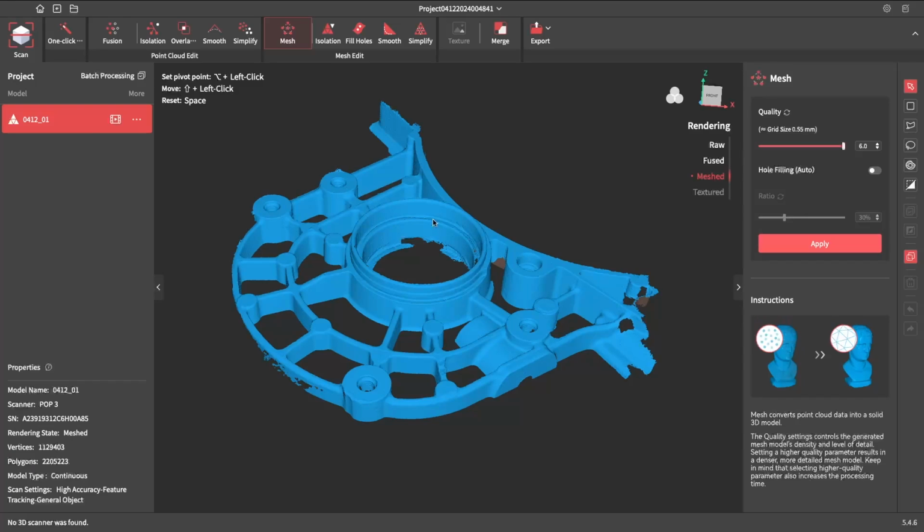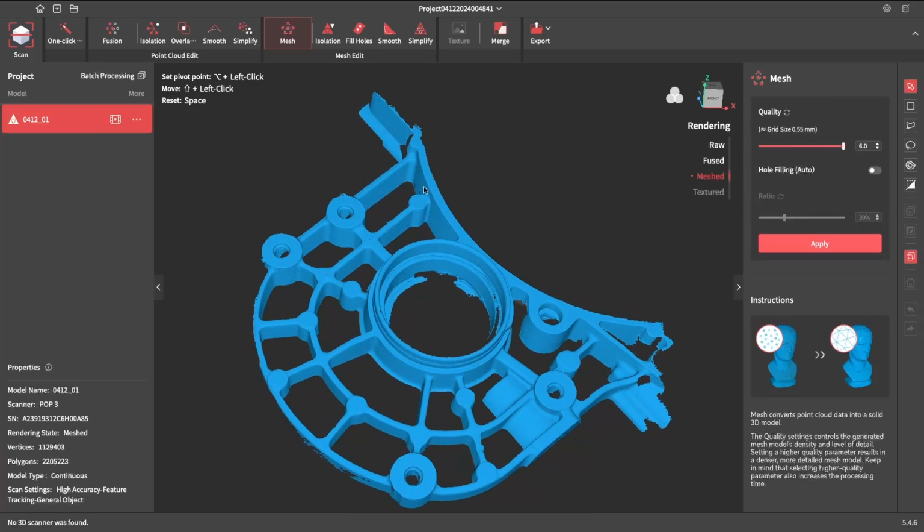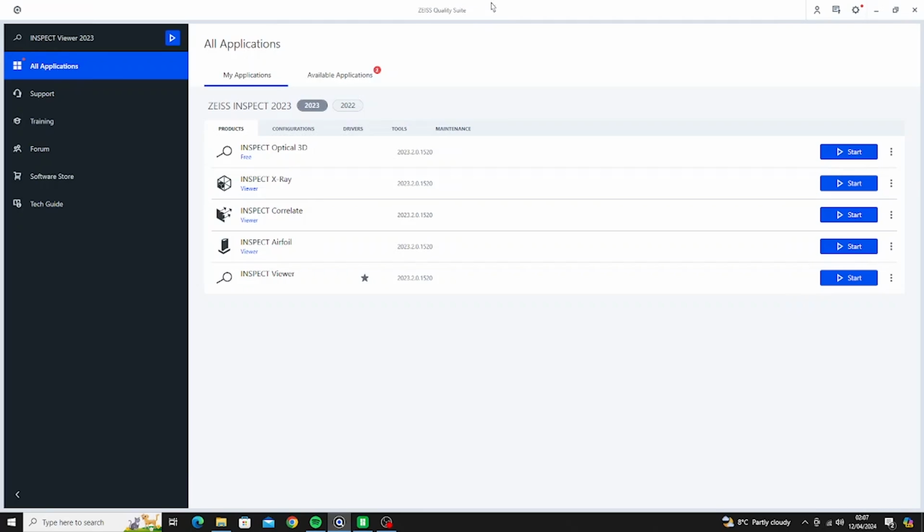We could have spent a bit more time on that, but for this I'm not interested in the overall accuracy of the measurement there. All I'm using that for is a center point. So as long as that's within, you know, like 0.1 millimeters with not all that much deviation across the scan, it'll be fine for our need. I'd call that pretty good. Now we're just going to go through, we'll export this as an object file or STL, and I'll get it over into GOM Inspect, now over on the Windows computer, unfortunately GOM Inspect doesn't run on Mac.